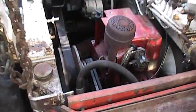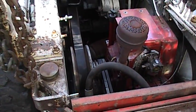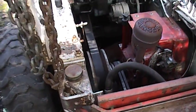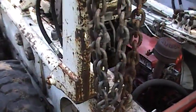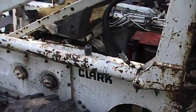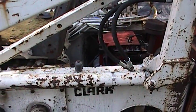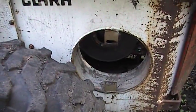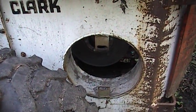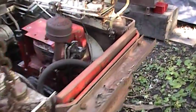Originally this one had a variable sheave in it so you could get different speed ranges, because these old Bobcats basically worked as a direct drive, like a snowmobile, and then everything else was hydraulic. Later skid loaders are all hydraulic. You can see down here — there's the clutch part, machined the two halves, and dropped the belt down to a lower gear range, but it works.